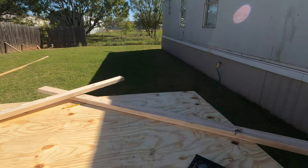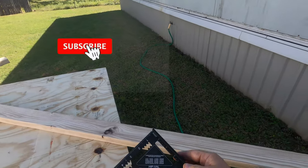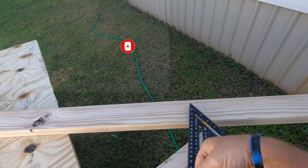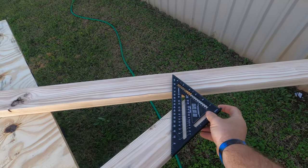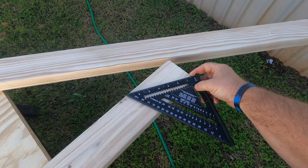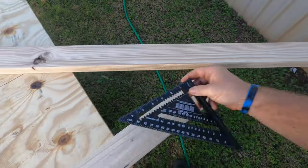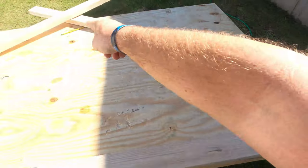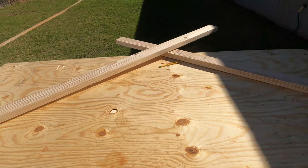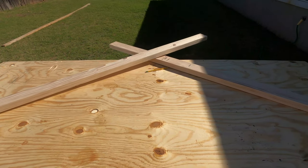Before I have to go back to work on November 8th. What I've done is I've taken my roofing square — this is a 90-degree angle, all 45 — and taking the pivot point and gone to 60 degrees, making sure I've got it right at the pivot point and marked it. So we'll use 60 degrees here and 30 degrees up at the peak, and we'll go ahead and add some bracing right down the center. We'll make it look good and keep it sturdy too.